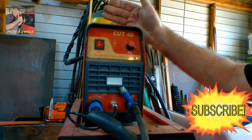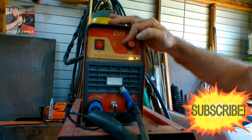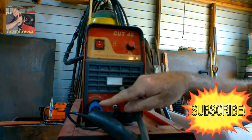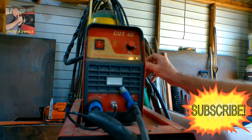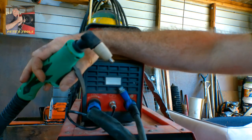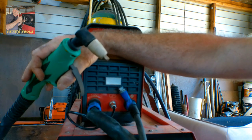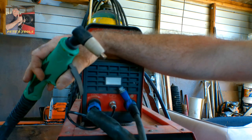If you're new to my channel, all I use is a cheap Cut 40 — just a 40-amp machine. It goes from 15 amp to 40 amp, just an on/off switch, real basic machine. Your torch lead coming in here, your earth clamp going off there, and that's just the switch for your torch. I use a PT31 torch head because it runs the cheapest consumables — and it's cheap, like me. I like doing things on the cheap, on a budget.